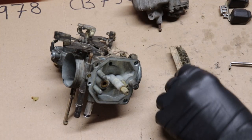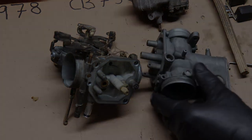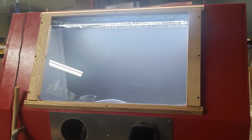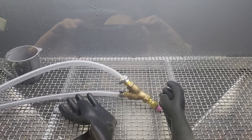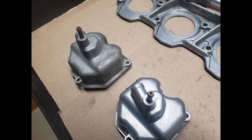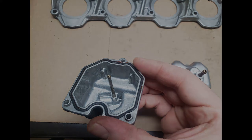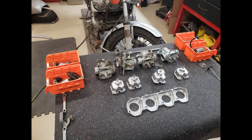Vapor blasting is kind of like sandblasting, except it uses a slurry instead of dry sand. The top portion is made out of Baltic birch sealed with epoxy paint, and the lower part is welded aluminum. My version is super basic - I only wanted to have what I needed to get started. Here you can see the pump is on and the slurry is being pumped through the nozzle; I'm about to kick the air on and you can really see it start to get to work. I'll be doing a more detailed video on the construction of my vapor blasting cabinet. You can see the difference - the vapor blaster does a really nice job on aluminum. Thanks for watching, and be sure to check out the next video on cleaning and reassembly.